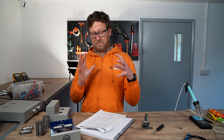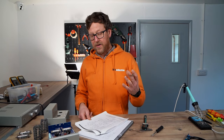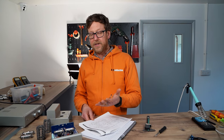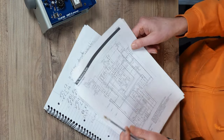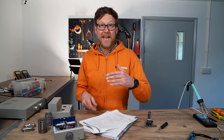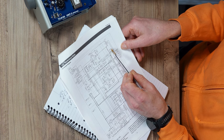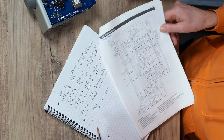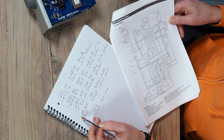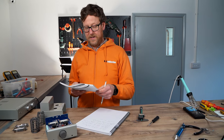Those are the key components associated with the circuitry of the valve. You can also change the feedback — generally with valve amps there is some feedback which gives the amp more stability. I can identify those because they generally sit off the output stage — it's a network of a resistor and a cap in parallel. I can see them there: C7 and R19, which is a 220 picofarad and a 2K2. That's the circuitry immediately associated with the signal path.